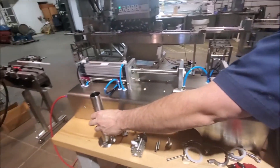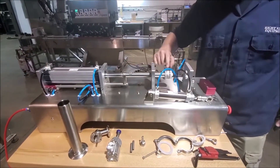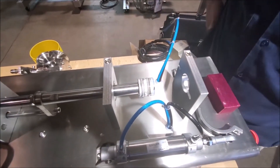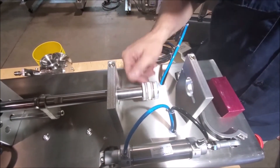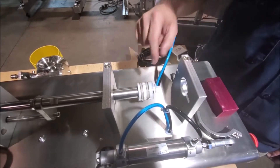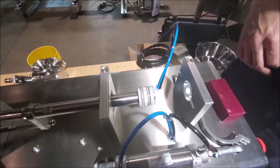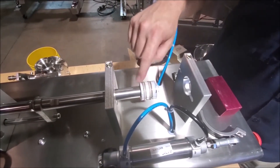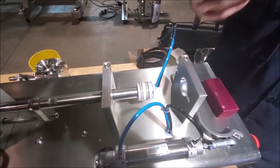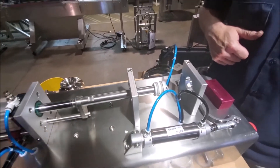So there's our product cylinder. You can see our piston here — we've got some food-grade grease on here and you can see our O-rings. Whenever we take this apart to clean it, we want to inspect our O-rings on everything on this system. Make sure they're not flat or broken. If you have bad seals, you'll pull air into your product cylinder and you'll get inconsistent fill volume. So if you are getting inconsistent fill volumes, two places to check: check these O-rings, make sure they're still good and not flat, or check your three-way valve.